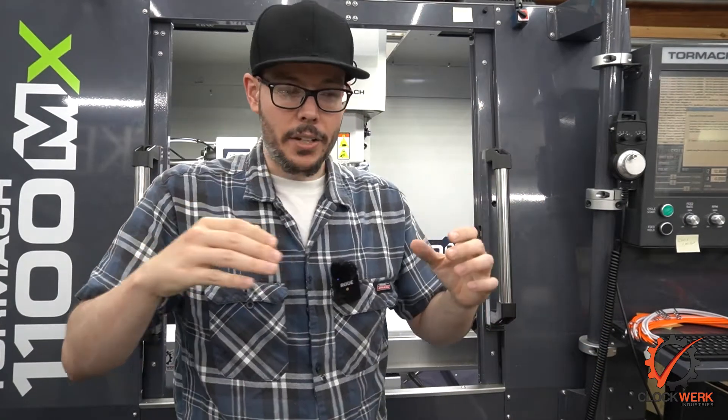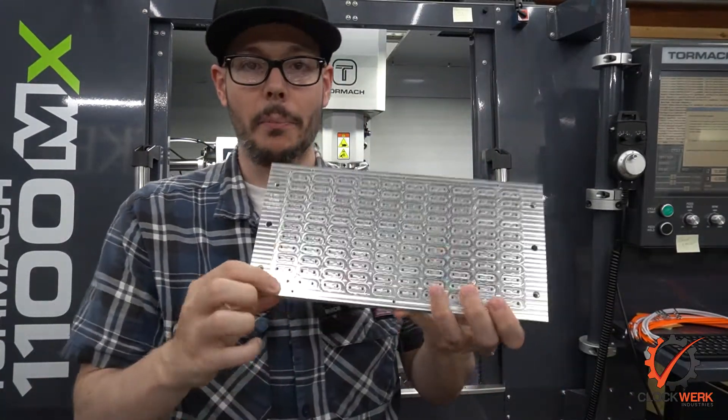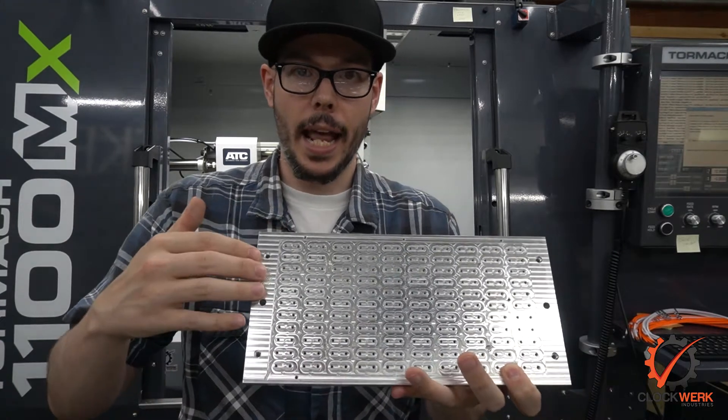Everything I do is flipped on the X or Y axis. I model all the parts but I don't program each one individually — that would require so much computer horsepower I don't think I could even get to the final part clicking all the segments to contour all those cuts. What I do on this fixture is program the bottom corner part, pattern it up in Y, then take that Y pattern and pattern it in X all the way across. That lets me program one part and cut an entire sheet's worth of parts — a very helpful solution in Fusion 360, which would otherwise be incredibly bogged down selecting all those contours.